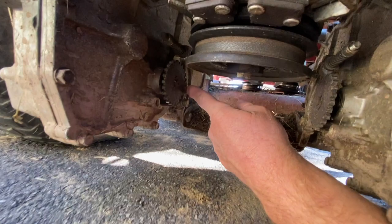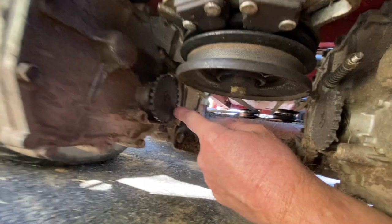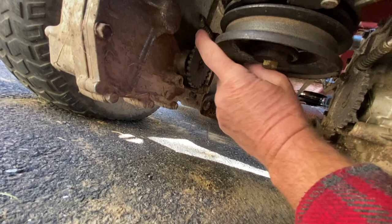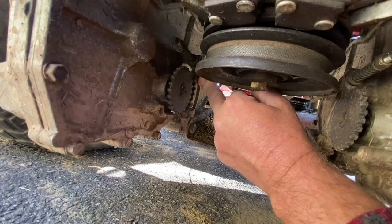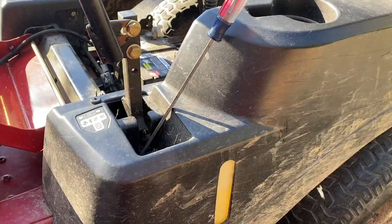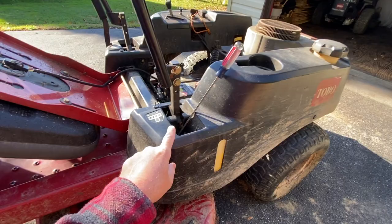So what the electronics are going to do is come back here to the back of the mower and engage the brake right here. This cog is locked into this safety bracket with the notches. So I'm going to have to disengage that — I'm going to have to pull this cog forward to keep it away from the wheel. I'm going to have to take this off so it doesn't think it should be in the parking brake position.